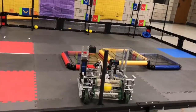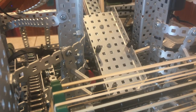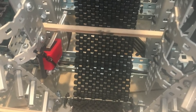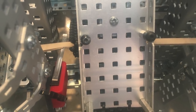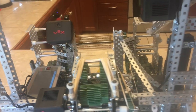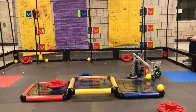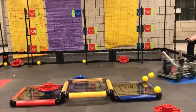The one caveat was that the catapult needed to be back in a very specific way, and I decided to use a limit switch to home the catapult. This needed to be mounted very precisely, and the best way I found was to use a rubber band to trigger the limit switch. This came out of the fact that if the limit switch was touching the actual catapult, it had a bad habit of getting caught in one of the holes, which would rip the lever right off the switch. The program basically told the robot that if the limit switch wasn't depressed, turn the motor until it was, which helped keep the catapult down. We did have a manual button, which meant that if the limit switch was malfunctioning, we could manually turn the catapult back.